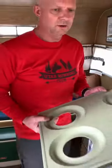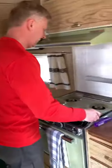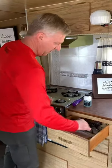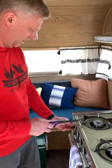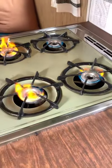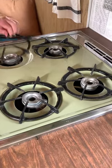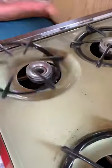You'll just need to check all the fittings you can to make sure they're okay. Once you've gone through all the fittings, go ahead and light things up and test them out. One thing to note — if you just put new tanks on, there's air in the lines and it takes a while for the air to purge, especially for the heater. This one still had gas in the lines, so I'm just going to light these all up and make sure they work. The flames are big on these — sometimes if the flames are too big, it means this part here is loose, so you just tighten it.